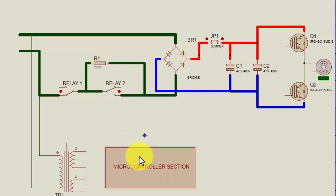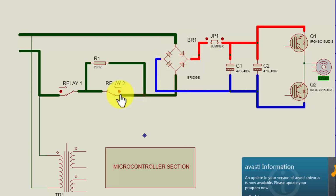to this resistor, so this resistor network dissipates more power, causing smoke and overheating. And after a specific time when the microcontroller turned on this relay, at that time this AC line was totally on the bridge rectifiers. This line here, here, here, here, and then here. So all the line voltage was applied to the bridge and short circuit. The bridge rectifier was safe because it was high current, and the machine was tripping the main circuit breaker. When we removed these IGBTs, our problem was solved.